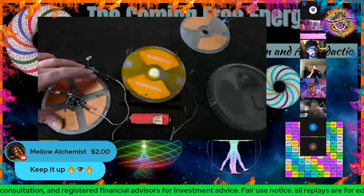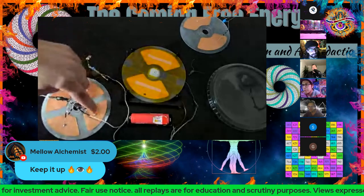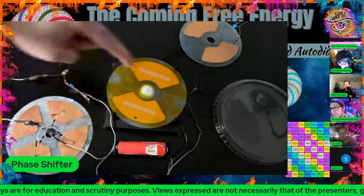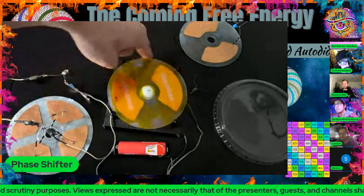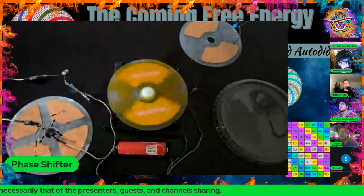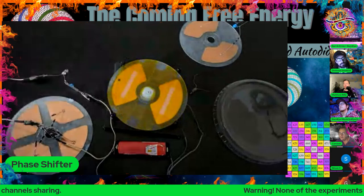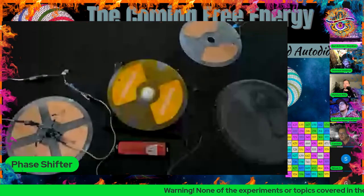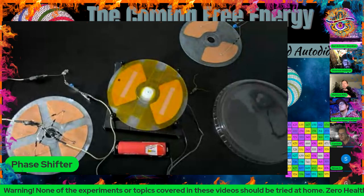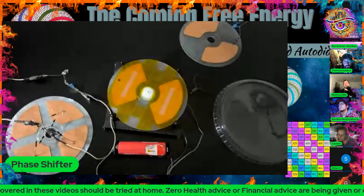And what we can do is set the frequency so that this plate and this plate section phase the voltage between themselves in a way that ends up arriving with this plate having the perfect opposite charge before these other plates have a chance to rotate into place. That allows us to draw these forward in the direction that we actually want to move them, for the sake of creating a charge motion between these two. And because we're never actually losing any potential in this circuit, we're just exchanging the position of where that potential sits, we can do interesting things with it, like send it through loads and allow it to be stored temporarily and put it back in at just the right time.